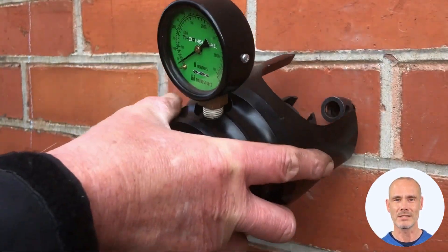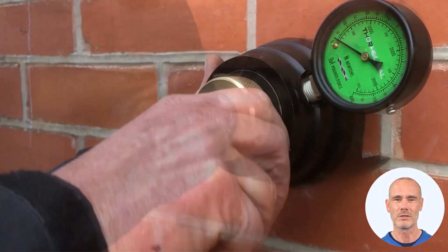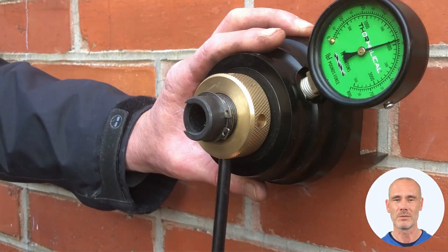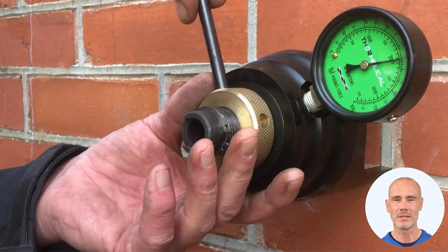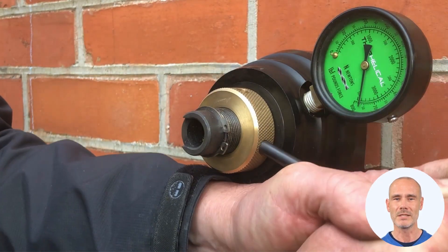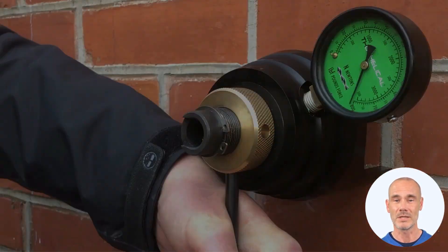Once the apparatus is ready to test the connection with either wall, tighten the brass nut. Use the tommy bar to apply a tension load to the specified value and record the result. Avoid needless overloading — pointless straining can damage the tester, the tie, or the masonry connection. To disconnect the assembly, loosen the nut to relieve the load and remove the unit from the wall.